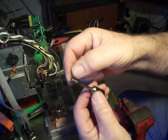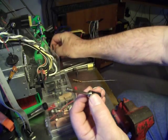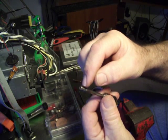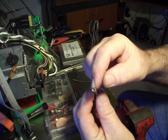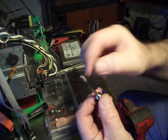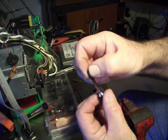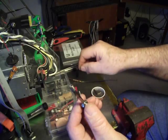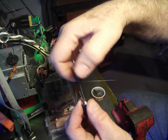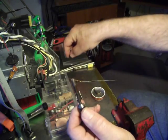For the threads — this tube didn't have any threads on it — so what I did was I took a piece of malleable regular steel rod, threaded it, drilled the inside of it, and then just press-fitted it onto the tube itself. I didn't solder it or braze it or anything, I just press-fitted it onto the tube and it doesn't turn or anything. So I can screw the tip on, change tips, and never have to worry about the element again.